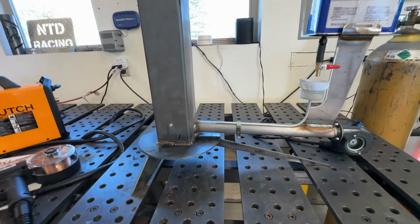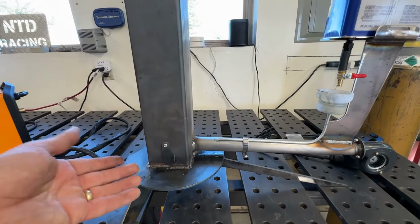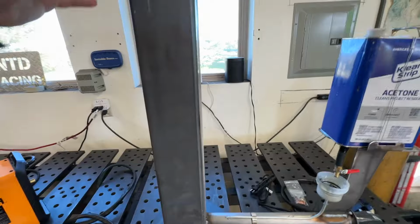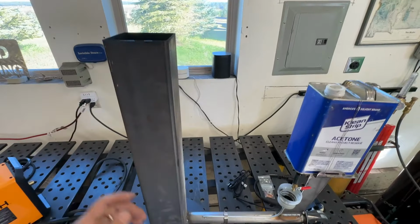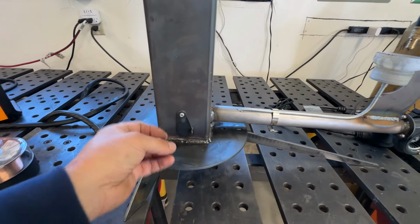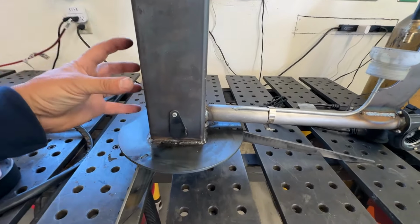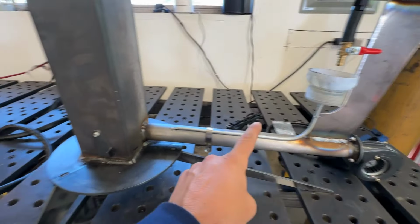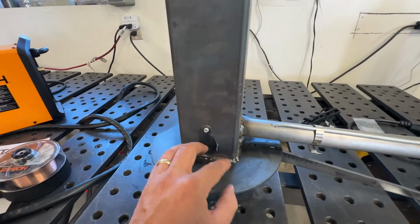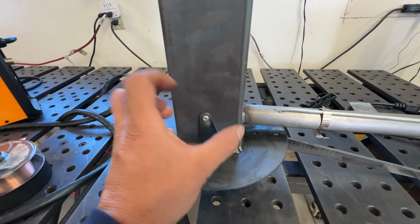And the other thing is, to light this thing off, what you might do is put a little bit of oil down there first by looking down inside. You can see the oil going in there, and then put some pieces of wood in there and get a fire going with that wood, because you really want this whole place to be almost red hot by the time you start flowing oil in, because the oil goes down this tube and starts dripping into the combustion chamber, if you will, which should be red hot.